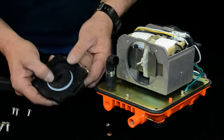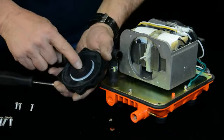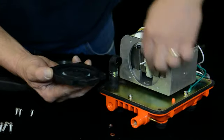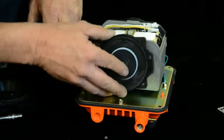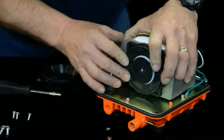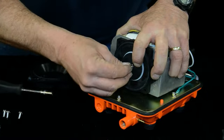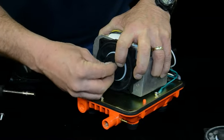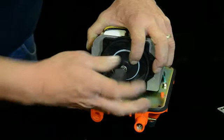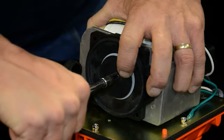The diaphragm — you can tell this side goes to the shuttle and the other side is where the washer and nut go on. When you put it on there, there's a little offset here; just match up the offsets with the face in the shuttle. Just snap it right in there — nothing to it. Then put your washer and nut on there and tighten them down nice. It's a lock nut so it'll stay in place. Just tighten it until it's snug — you don't have to overdo it and strip it.